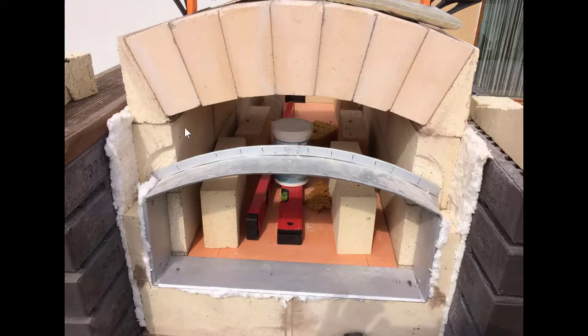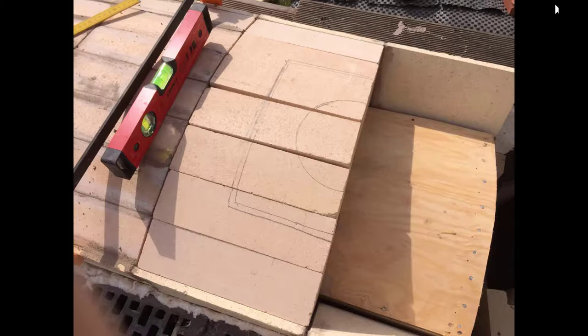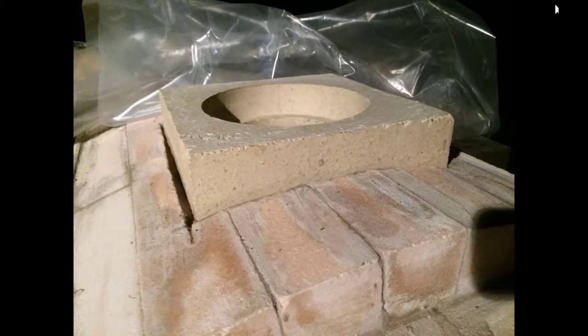There is an extra space between the door and the top where smoke is collected and then travels to the end of the oven. The idea is that you put the fire at the beginning of the oven and the smoke goes to the end so the full oven is heated. Next we made another layer of ceiling with the exhaust output. With the tool we prepared the bricks and built the connector part quickly, and the full ceiling is now done and ready.